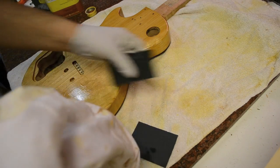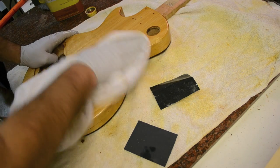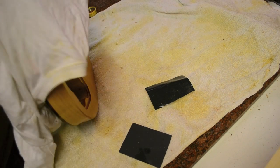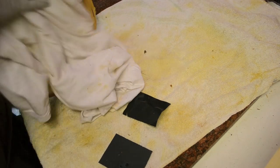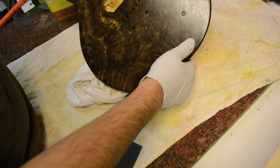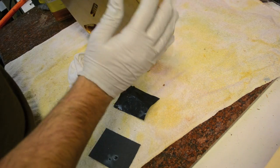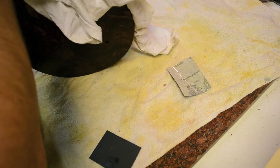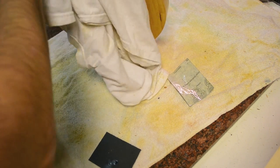When you're done, get your towel and just wipe off all the boiled linseed oil, let it dry, and you can add another layer of TrueOil after that. Usually I'll let it dry again another 24 to 48 hours. And there you go — all the linseed oil has been wiped off. It feels really smooth on the sides, smooth on the back, nothing really catching your hand. So I'll let this dry for 48 hours and come back and put a couple more coats of TrueOil. I won't sand again, but this just gets the coat nice and level and perfect.